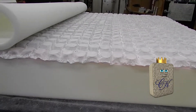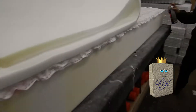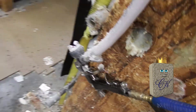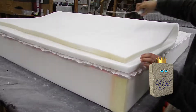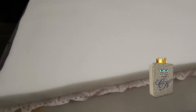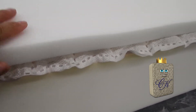Most of our competitors are using just can glue because it's easier. Using a water-based glue costs a little bit more and a little more maintenance — you've got to clean the glue gun every few days, it gets clogged up. But it is better. In this case, we don't want permanent glue underneath this layer, because if anybody ever wants to do a comfort adjustment — maybe they want to make it firmer or softer — we might need to remove this layer of foam down the road, and we don't want that to be a permanent bond.